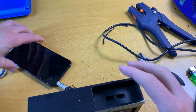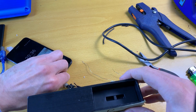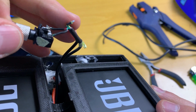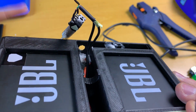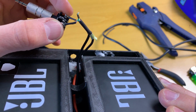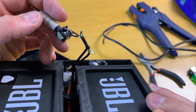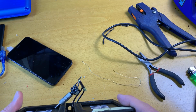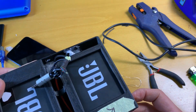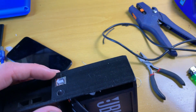Okay, this is now really interesting because I tried around a bit and I disconnected the ground and it was still playing, but still just out of this side. If I connected either one of those two, either the left or the right channel, then the whole sound got dead. I don't know, because actually I fried the Bose box before, so I'm quite careful with that.